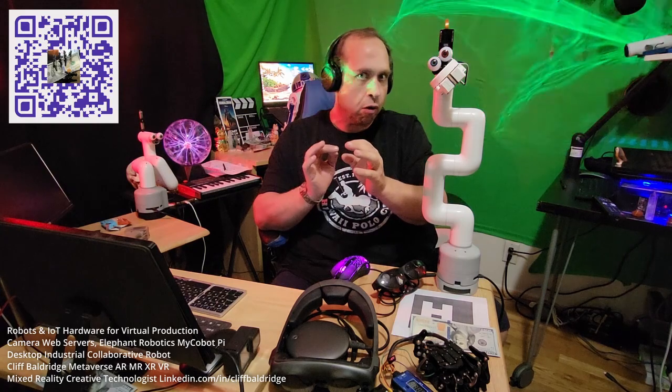I want to help you in case you have to troubleshoot. When you turn on the program and turn on the robot, you're going to want to then plug the gripper in. If you run the program first, the gripper is not going to work — you have to have everything enabled and then plug the gripper in. Since it's a Raspberry Pi, it's kind of the other way around from what you might expect.